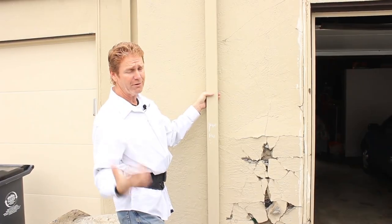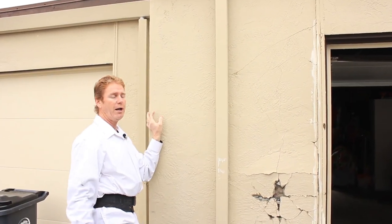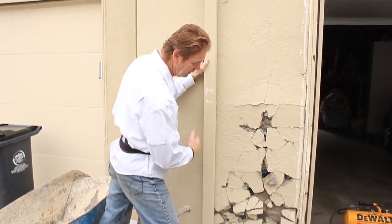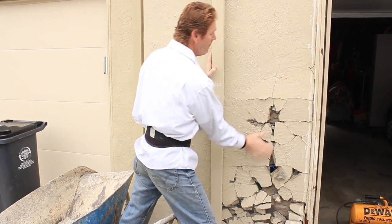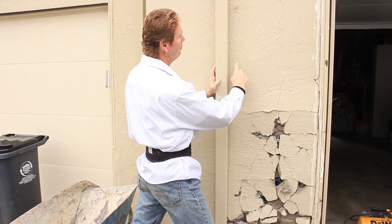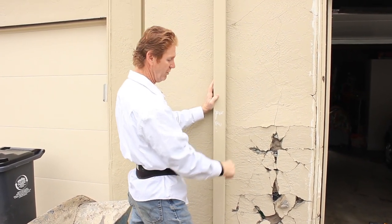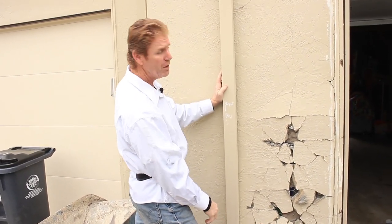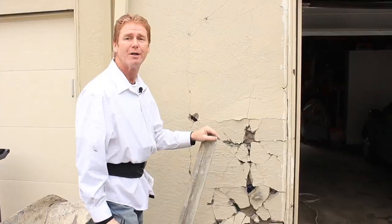Like I tell everybody, if you want me to waterproof it and guarantee it, you've got to take the whole square off. Nine out of ten people say, Kirk, are you out of your mind? Just do what's necessary. So we're gonna take it, remove the spout, take it to about right here. We're gonna put new lath, scratch it, brown it, and then texture it all the way to the top with a bonding agent. This is a Santa Barbara Smooth Mission finish, and they're real tough to match unless you go from corner to corner, ceiling to top. Anyway, we're gonna get started and bust it all out. When we get to the stage of scratching, brown coat, and repair, we'll show it to you.